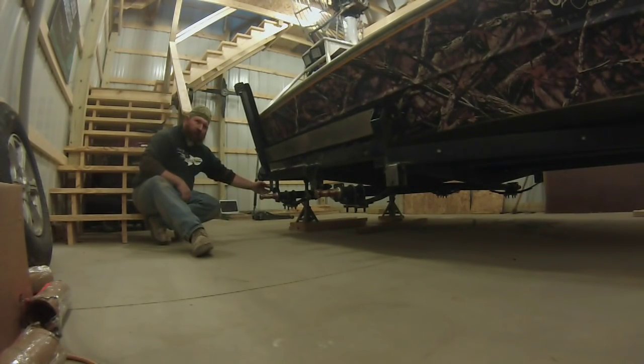These bolts are grooved. So you want to just hold the bolt still, put the air on the other side of it, and watch that bolt pull all the way up to the hanger. And as soon as it gets to the hanger, stop. You can't even stop just a little bit before then. But you want this to move. It's a little stiff right now, you know, but once it gets weight on there and gets moving down the road, it'll free up quite a bit.